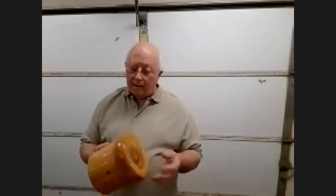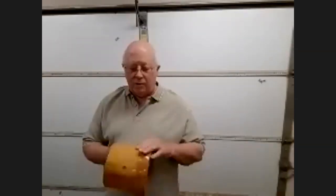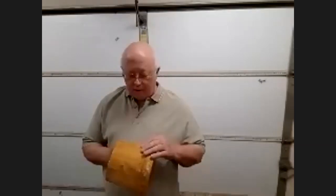The problem for me with epoxy — and it's probably not a problem — I'm one of these guys that I don't like to do a whole lot of work. You have a dry line — I'm going to call it a dry line — it's when you put the epoxy on. I had a tenon on and put the epoxy on here first. I was able to epoxy the inside and the outside, and that worked out great. So I got two coats of epoxy. The first coat — all the little air bubbles and imperfections kind of get filled. You come back, sand it down with 150 grit sandpaper, put the second coat on after it's dried, and it will fill up all the imperfections.